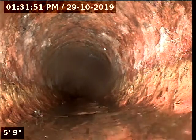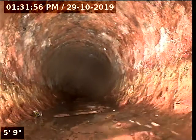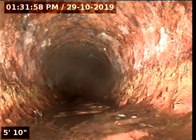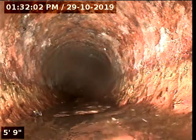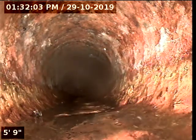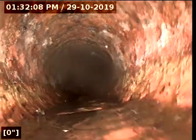The purpose of this inspection is to determine the overall condition and serviceability of the sewer lateral for this property to the city main. As you can see, we're in cast iron still. There's some flaking, some deformity, a little bit of corrosion — that's common in cast iron pipes. I'm going to zero out my foot counter here as we make some turns going towards the city main on the south street.